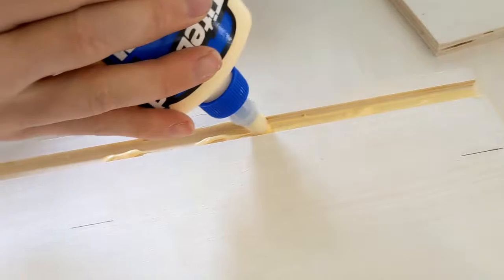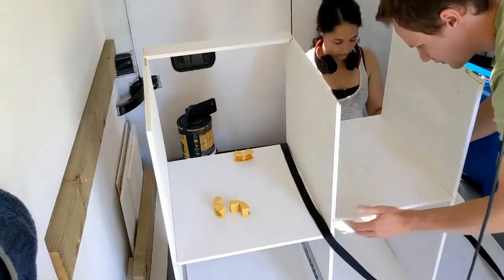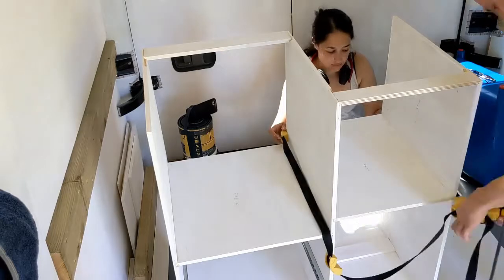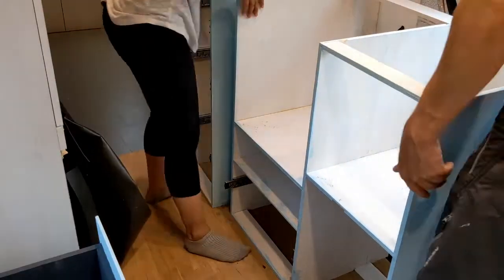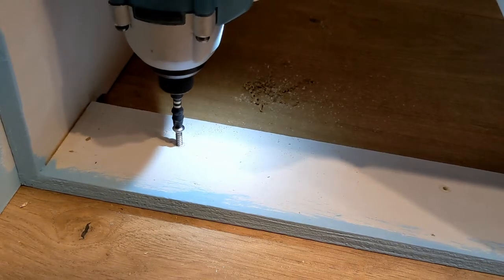We're going to glue it up and clamp it, and this should be what the end of the kitchen looks like. Because the first section was still kind of flimsy we've built this one a little bit differently — we're using those same rabbit joins on all of the cross supports, so hopefully this one will be much sturdier. Because our floor is a floating laminate floor you're not really supposed to screw into it, but we do need to get through it to secure our kitchen units to the battens below. We've been drilling a pilot hole all the way through and then enlarging just that top layer of laminate so the laminate can still shift, grow, and shrink as needed.